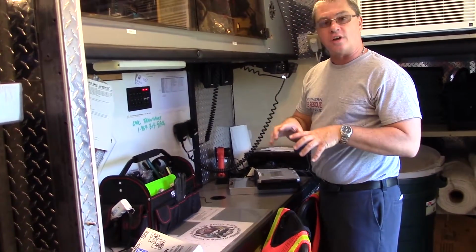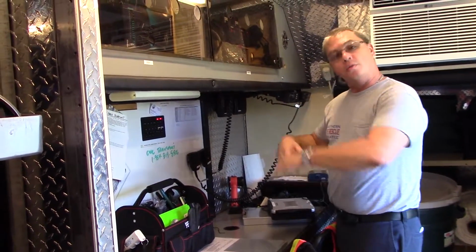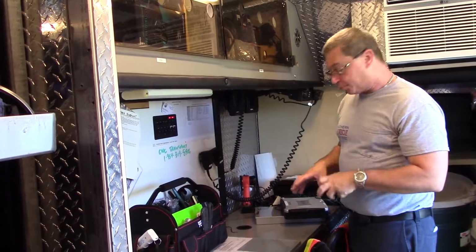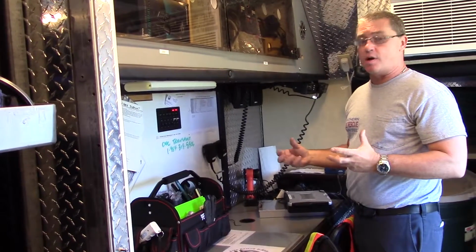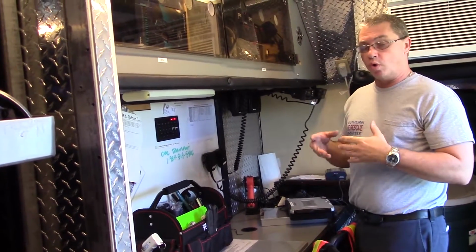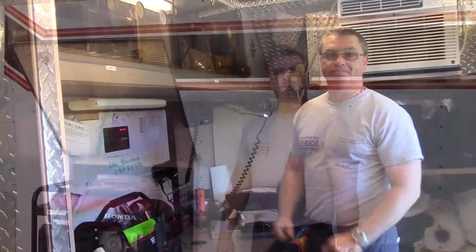And if at this time you do have a power shutdown, your lights go off, your AC goes off, revert back to the steps of resetting the inverter, running off of truck power. And basically, those are the basic things you need to know for getting HazMat 1 up and running for power on a 1 hour or less scene using the truck power at any given time.